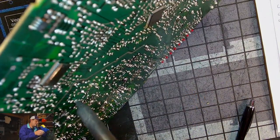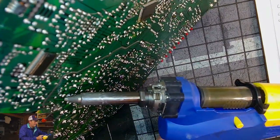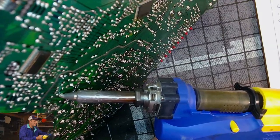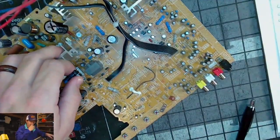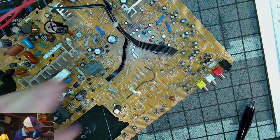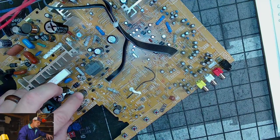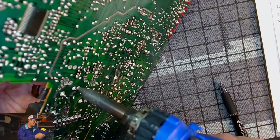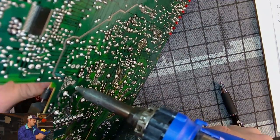Oof. It's weird. If it was good solder, it would just be molten still and look good. But I don't know. I think there was a note on the circuit board. We'll look for it. I may have been mistaken, but it might have said lead-free. If that's the case, that would make some sense, where it had lead-free solder, and the solder just doesn't look as good after 20 years. C550, 16 volt 1000, good stuff. Excellent, so we're making some progress. We're going to go now to the C527, which is this one right here. And we're slowly making it through this power block.